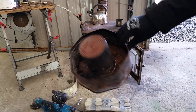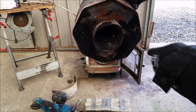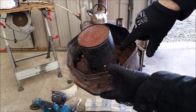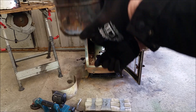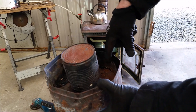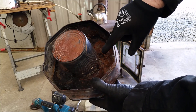Prototype number one was a biscuit tin and a dog food tin. I cut a hole in the bottom of the biscuit tin with a chisel, got as tight a fit as I could, and drilled holes about eight to nine millimeters in diameter. The reason for that is I want the air to come in from outside the stove through the bottom only. All the combustion air goes through this port, sucked in by the flames as oxygen rises up the flue and more air comes in to keep combustion going.